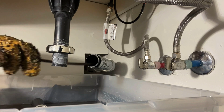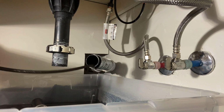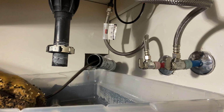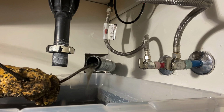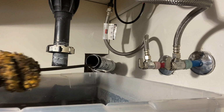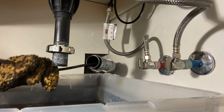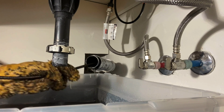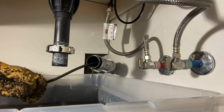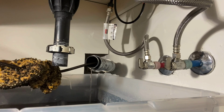So I really just did the modified trap arm to show you guys and demonstrate it. This is a Jack and Jill sink, and I'm trying to drop down the T in the middle. It's very difficult. They already had somebody come out who tried and wasn't able to do it. But I've always been good at this, and I'm getting even better at being able to drop down the T's now, especially using the 5/16 cable with the drop head and the hockey stick bend on the tip.